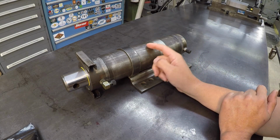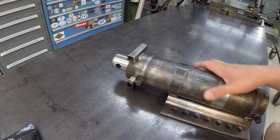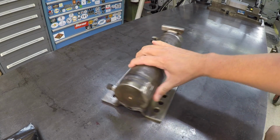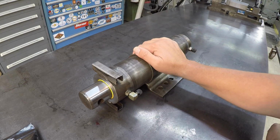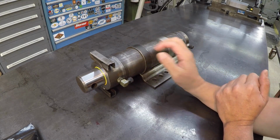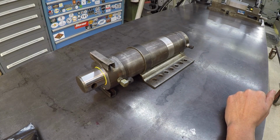And I got it welded on there and noticed that it was wrong because I looked at my pictures and noticed that this was turned 90 degrees the wrong way. So I just cut those welds loose and rotated it 90, dressed those off, and then re-welded it there at the bottom. Okay, so we got that done, and I think my customers, which is Mom and my stepdad Fernando, are going to be happy with this. And we get it painted and get it put back on their RV there.